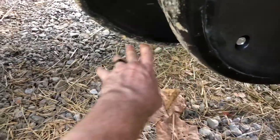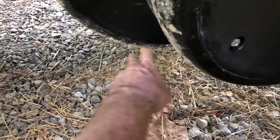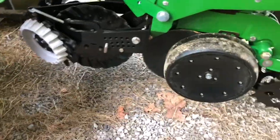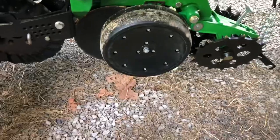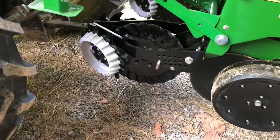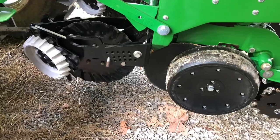I want this coulter running just shallower than my opener disk. The method I saw in a video was to get everything level, put a level board under the opener touching the bottom of the opener disk, and then measure about a quarter-inch gap between that level board and the coulter. That tells you it's set about right. I want to see where mine falls. I don't want to have to make an adjustment since it looks like it's almost a half inch of change. I'll get some water in for weight and see if I can get the openers and no-till coulter down enough to gauge where the row cleaner needs to be.